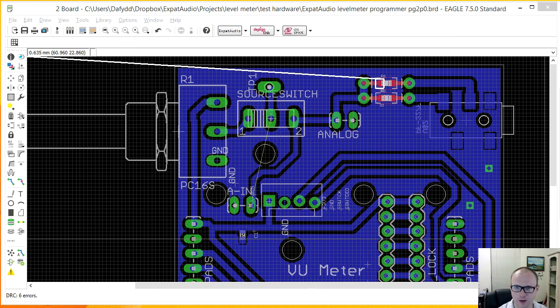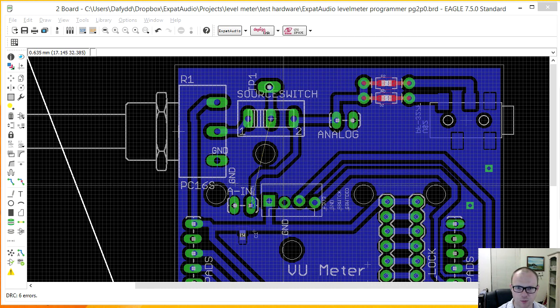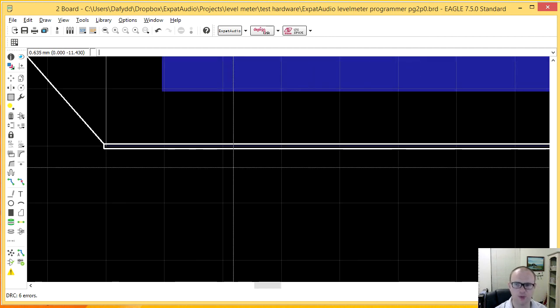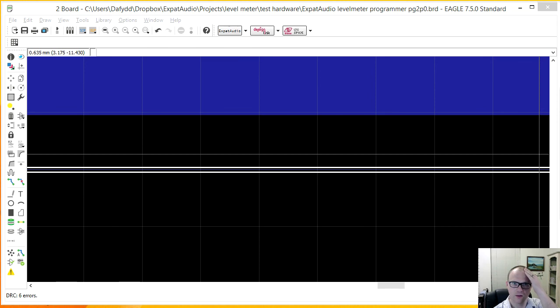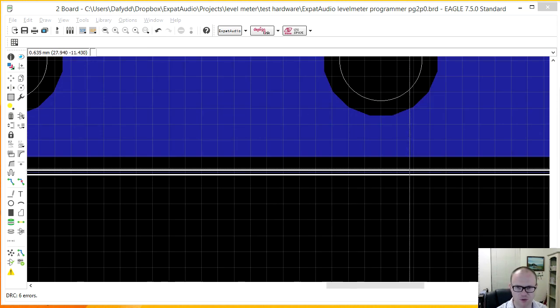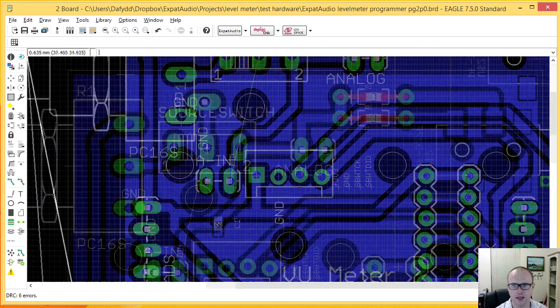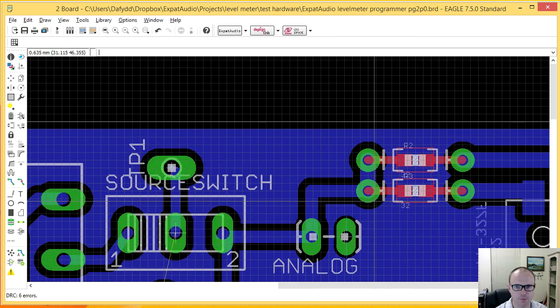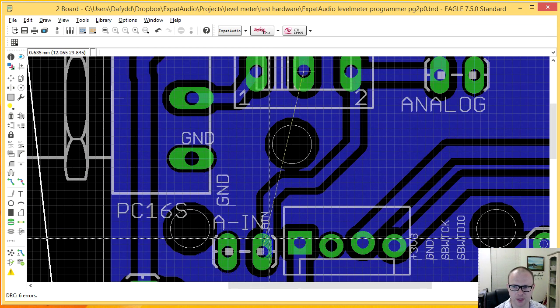So I have an overlap, overlap, overlap, overlap, overlap, width, width. What's it complaining about for width? Probably complaining that the width of my polygon is too bad. So I'm not going to worry about that. And the actual overlap caused up here, I'm not going to worry about it. It's actually complaining that my trace is overlapping the pad itself. Again, that should still generate just fine. And then it's complaining about this one here because it's saying this shouldn't go onto this pin.